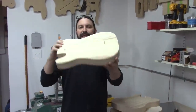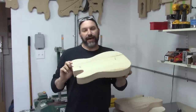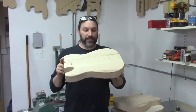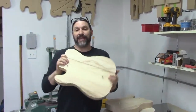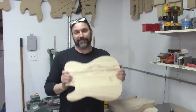All of the bodies now have indexing pins and we can put the templates on and take the templates off and put them right back on again, and they'll be the same every time. The next step is we're going to put the templates on and run all the bodies through the shaper. It's going to make a big mess and it's unbelievably dangerous, so it's one of my favorite things. Let's do it.